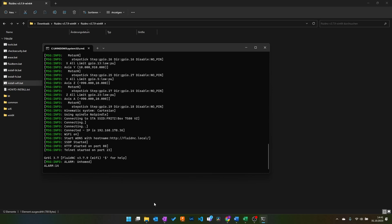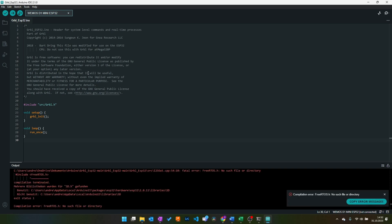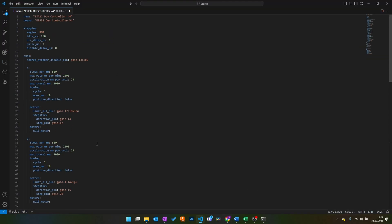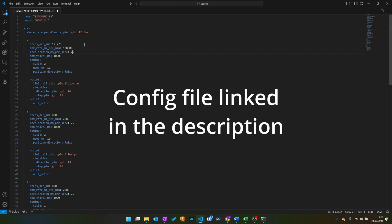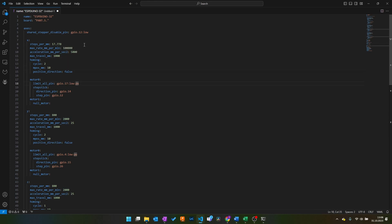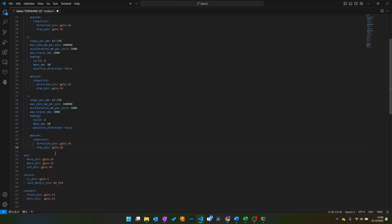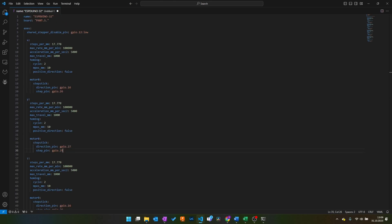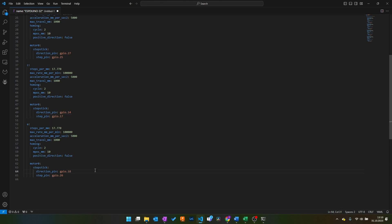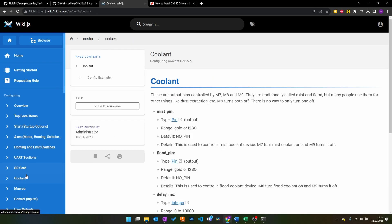After the upload, we have to configure our machine. Unlike Grbl ESP and Grbl before it, you don't have to compile in the actual configuration of your machine. The setup of the pins and machine functions is defined by a YAML file which can be uploaded to the file system of the ESP. The config file is stored in the internal flash of the ESP, so no external SD card is required. To create the config file, I entered the pins I had defined earlier into a config template provided on the FluidNC GitHub. I just deleted everything I didn't need and added one axis. The FluidNC wiki has a great section about writing config files — you should check it out if you plan to write your own.